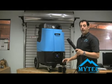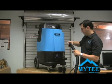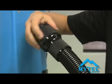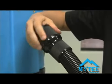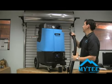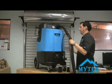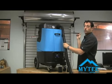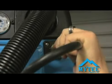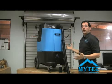So we'll take our 1.5-inch vacuum hose, unthread the vinyl cuff, thread on the cufflinks, and then it's ready to be put onto our starter cuff. It's very simple. Twist it on clockwise for a positive seal. Then we're ready to put on our solution hose. Now with QDs, simply pull the ring back on the female, snap in our male, and we're ready to run. So now that we've gone over the features and the functions of the M12, let's put it to work.